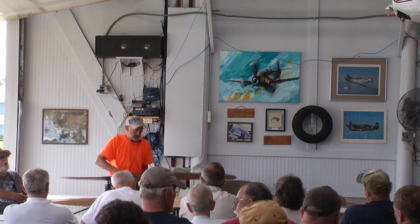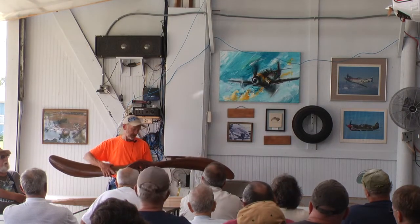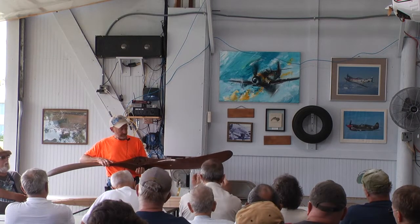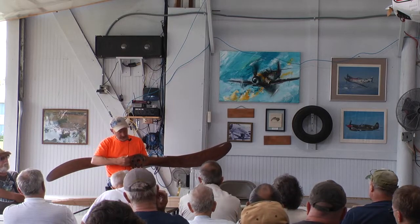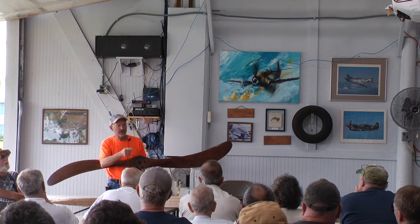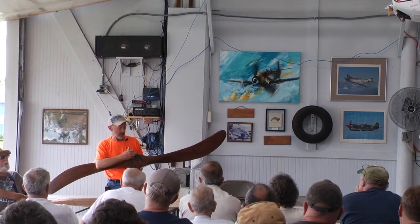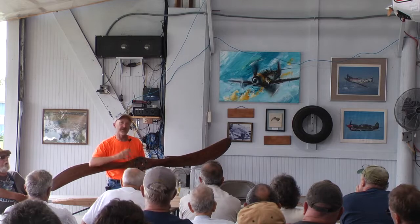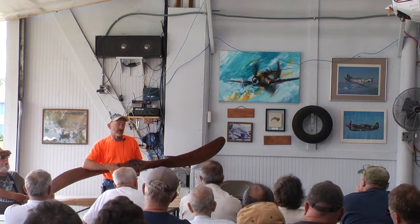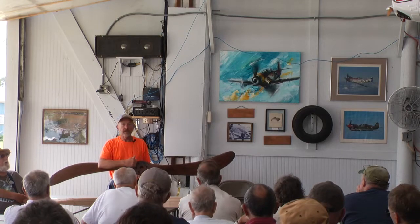These holes here? Yeah, sure. I'll get to that. The gentleman asked, do I seal the inside of the holes? Yes, you end up sealing the inside of the hole. Now, on a common propeller hub, the Continental style propeller hubs, there are pilot bushings that extend 1/2 inch or 5/8 into the back of the propeller to have more surface area to turn the propeller, and you have to accommodate for that. So I just took a drill press and used Forstner bits to drill down to remove the material necessary to have room for those bushings.